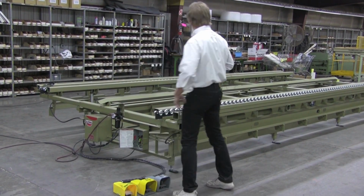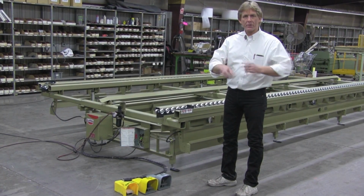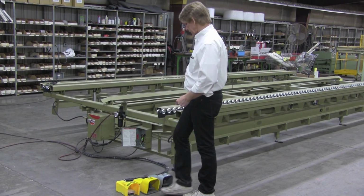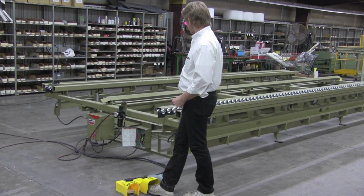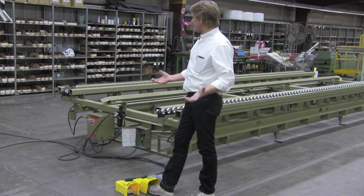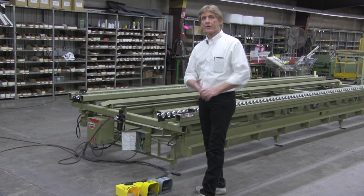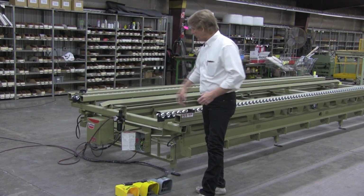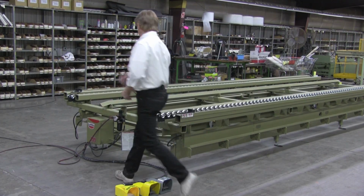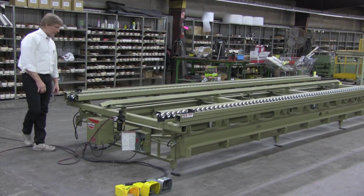You're still running a torque limiter on the end of the main drive shaft of the motor so it can slip once you get to the end. Anyway, real slick system. Run it for you one more time. But you're going to throw a tape measure across. If you want to do a 9'3" or 9 foot, 10 foot, 10'3" because you want to do a double top plate, you can actually open up the table just a little bit more. You need to open up about 2 inches or so. Throw in your double top plates on either side.